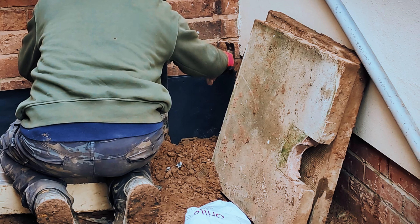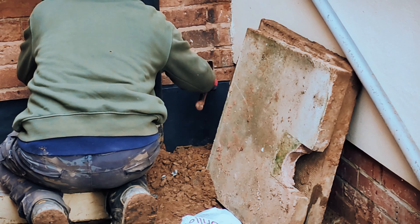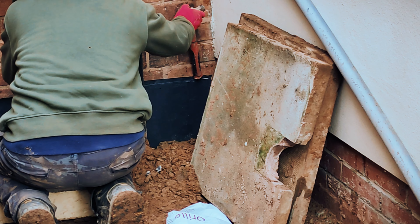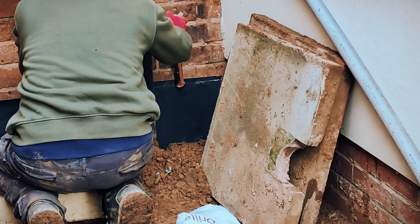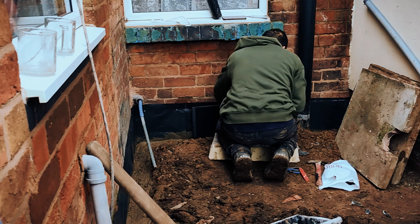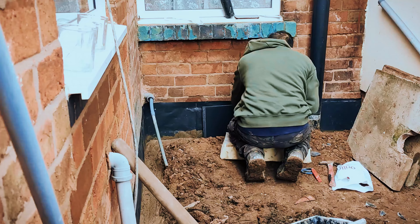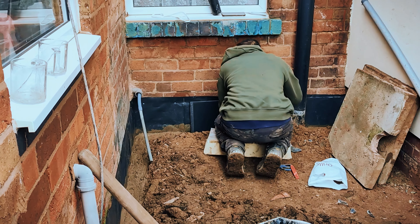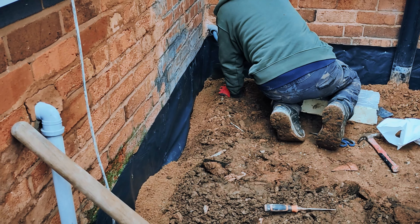In the UK we get a lot of rain. That rain butts up against the walls. If a wall has a damp proof layer, you basically have a better quality brick below it, so water can just funnel away into the gutter. What they're using here is the plastic sheet on the wall tacked in place, with a screed — a sand and cement mix — in the bottom, creating a new concrete area for water not to pass into the building.